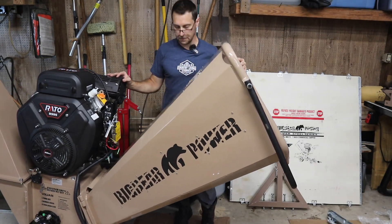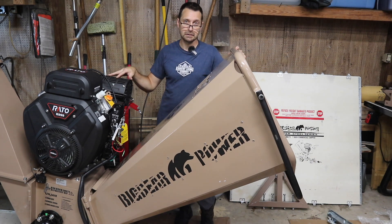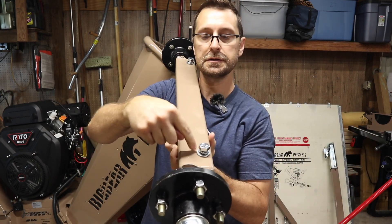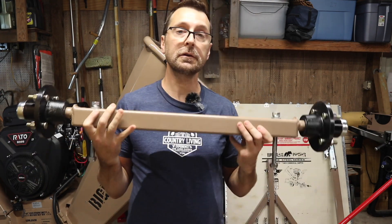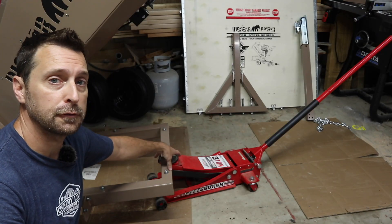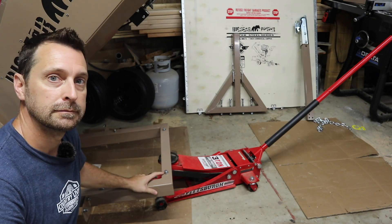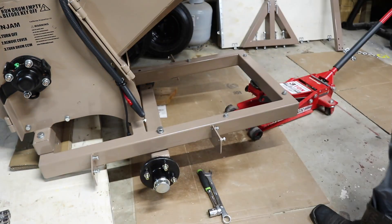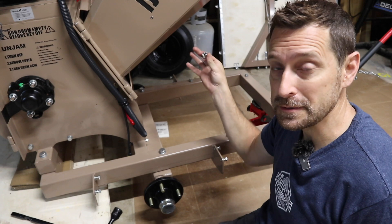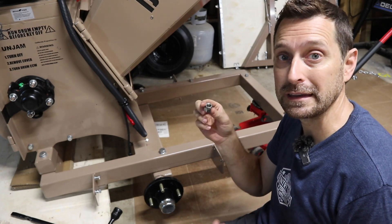When you put that chute on it is heavier, so it is going to tip your assembly forward. Just set it down on the ground and let the rear part of it rest on that pallet. The next part is to install the axle. This axle goes with the larger space toward the body of the assembly. The manual says to have two people to work on this just because of the stability of the entire assembly. If you're careful you can just use a floor jack — jack it up on this side, make sure it doesn't tip over, and that center of balance is correct and you should be fine. After you get your axle on you need to take the lug nuts off to get the tire and wheel assembly on there, but these were on so tight from the factory I had to use my own tools to get them off.